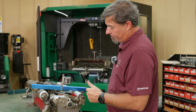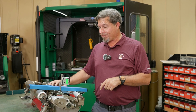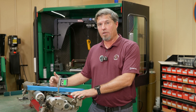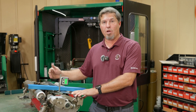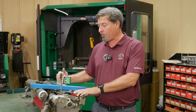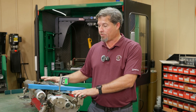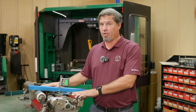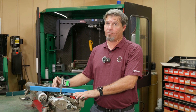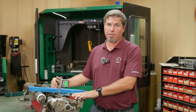If we ground this bed knife and took off 30 thousandths or so, we'd be back close. The reason I don't like running an extended bed knife on a standard bed bar with behind center distance in front of center is that it lays over a lot of grass — especially with Bermuda being thick and puffy, we're just pushing it over instead of cutting it. And what happens if you do that for a long period and then put on a standard or short bed knife is you're going to be a lot more prone to scalping. We had a scenario switching from Toro units to John Deere units; the John Deere units were more aggressive and I used the BC Master to dial it back, getting it back in front of center since it was end of July — not a time on Bermuda to try to bring it down.